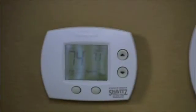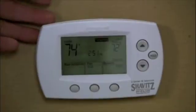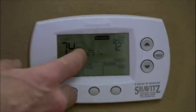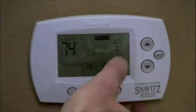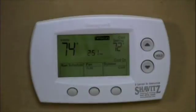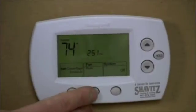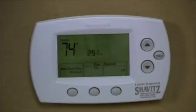We're going to move on to the Honeywell Focus Pro 6000, which is the digital programmable thermostat. This is a great thermostat to program temperatures at different times for energy savings. As you can see, it shows you the time of day. On the left side you have your inside temperature; on the right side you have your temperature setting. When you push a button, the backlit screen comes on. You still have your system cool/heat/off to toggle between heating and air conditioning, and your fan auto/fan on button to have the fan come on 24/7 or to circulate just when the heating or air conditioning comes on.